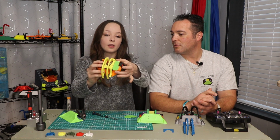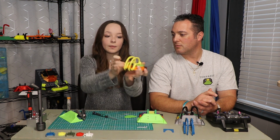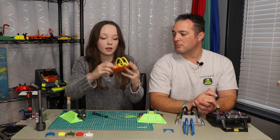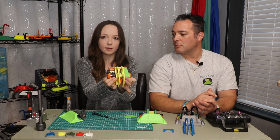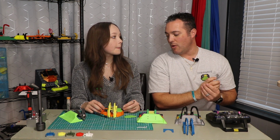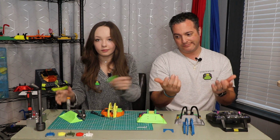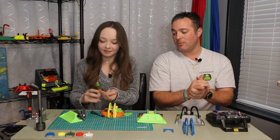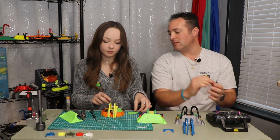And one thing about the top armor, it's kind of going to force the front and the back together, to squeeze it together, and that is just another way to make sure that the motor stays in really secure. So you might have to squeeze it together a little bit to get the second screw on, just because that's how it's meant to be, to hold the motor. It closes the top so that the motor can't come out. With our new snap-in motor mounts, in competition you can still use a zip tie, so the features are there to add a zip tie around the motor. You don't really need to. I mean, if you took a direct hit from a vert, maybe it would pop up, but that's why the top armor helps squeeze it so that it can't open enough to let the motor out.